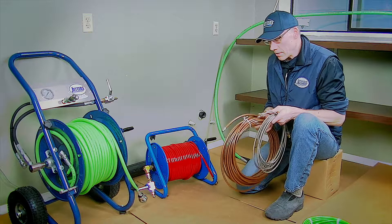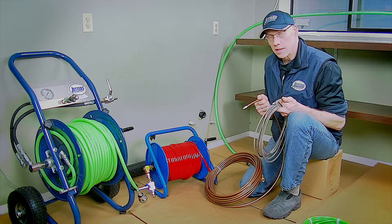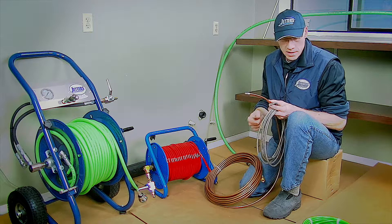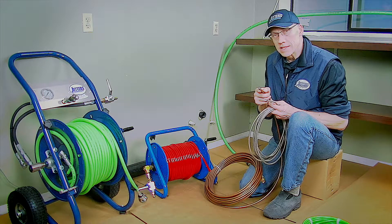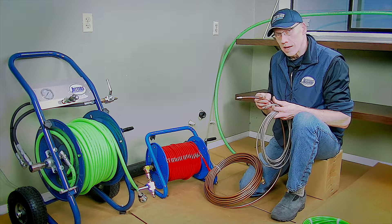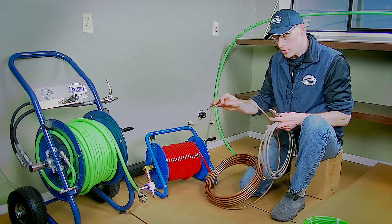What makes these different is that there's a steel braid inside, or stainless on the outside. The steel braid can hold pressure in with fewer braids than a typical poly hose, like the eighth-inch. That allows for the bigger inside diameter. It also gives another advantage — besides the fact that it can pass more flow, it can almost be tied in a knot before it kinks. It also makes it what we call pushable.